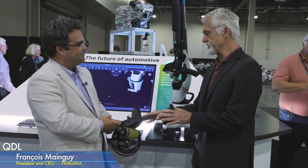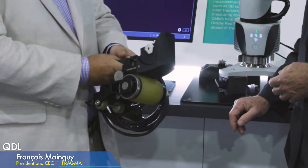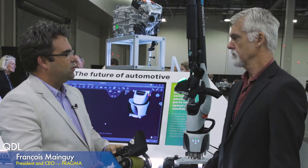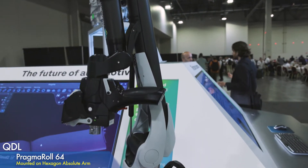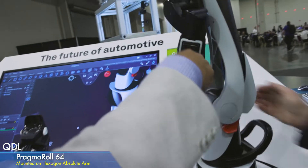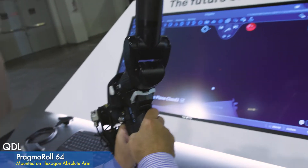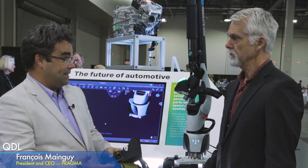What kind of sensors is this using — ultrasonic? Yes, this is using ultrasonics. Both that I'm presenting today are using ultrasonics. These are typically very high-frequency acoustic transducers that will penetrate the material, and that's the key part. Metrology typically ends at the surface, and we dive into the material to figure out what we have inside.